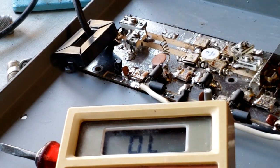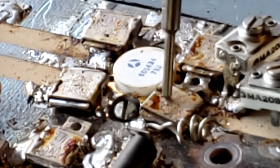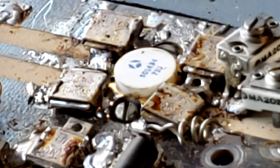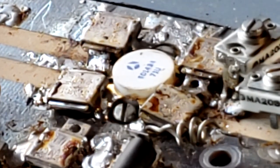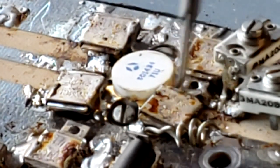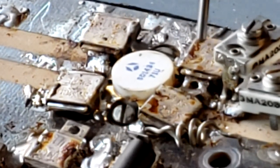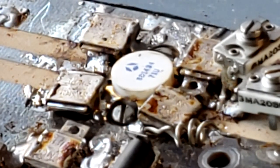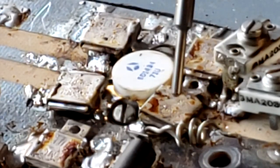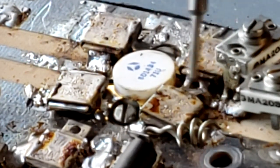That's not good. Given that the transistor diode characteristics look good, I am suspecting either this capacitor or this capacitor has got a resistive element to it. This particular site came out of Eaton, and originally it had been damaged by mice living in it. So if any of the urine, etc., got into these open-air type capacitors, they're mica capacitors, but certainly open to any liquids getting in, that could have created a resistance. So we are going to disconnect these two capacitors one at a time and measure the resistance and see if we can track down the 5 kilo-ohm resistance. If we remove both of these and it still has 5 kilo-ohms to the base, then we'll look at these other capacitors in the system as well.